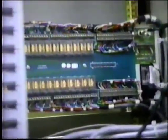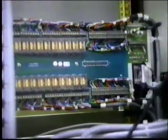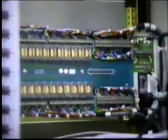Oh, okay. Well, I was going to look at the back of the other remote control. There you go. Notice the little relays? Each of those are associated with a control channel. 16 control channels, and there's a raise function and a lower function, or an on and off function, if you will, for each of those 16 channels.